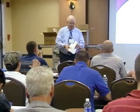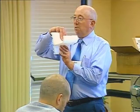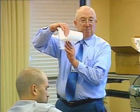And if you don't like a straight cleat and you want something that's going to give you a little more capacity going up the hill, you can get something like this that almost forms its own little bucket, if you will, to hold product in here as you run at very steep angles. Okay?